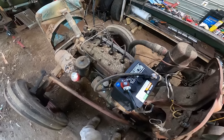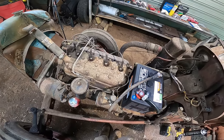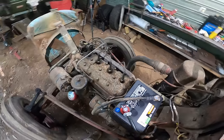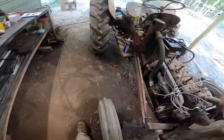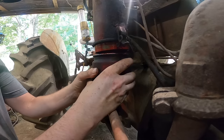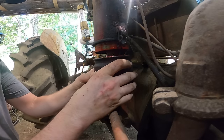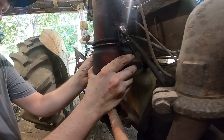that's a good sign. Let's get this gas tank hooked up or get this carburetor off and clean it out and see if we can get some gas going to it. Or you know what, let's shoot some starting fluid down the intake, see if this thing pops off. Let's check this thing out first. See what this thing is looking like. Well, that looks fairly clean. Clean enough, at least right now.